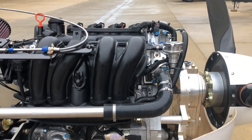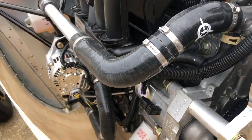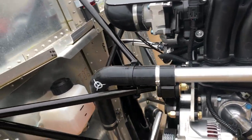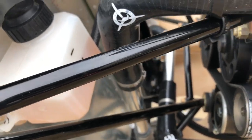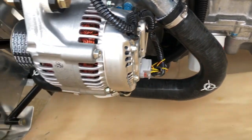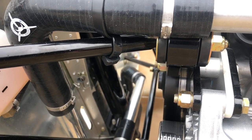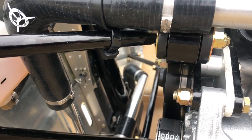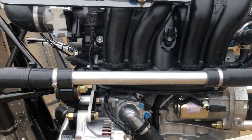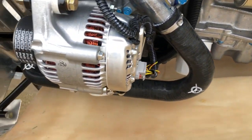A little more plumbing — meaning the cooling lines and hoses. Just coming off the head here, this is a departure from the past. With a 45-degree fitting down there, a 90, coming aft, and then straight down into the radiator. From the thermostat housing, 135 degrees coming aft, going over, and then into the other side. Details are in the installation video. Small change here: coming straight back with the top hose rather than going down, because it gets a little cluttered down there trying to get by the oil filter.